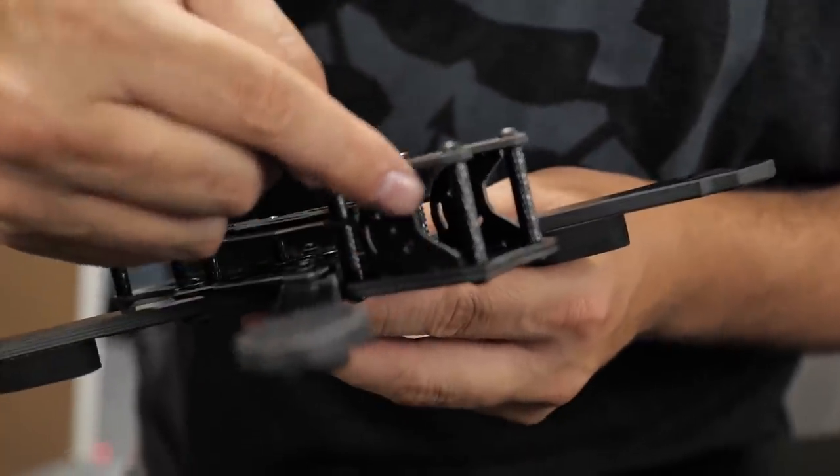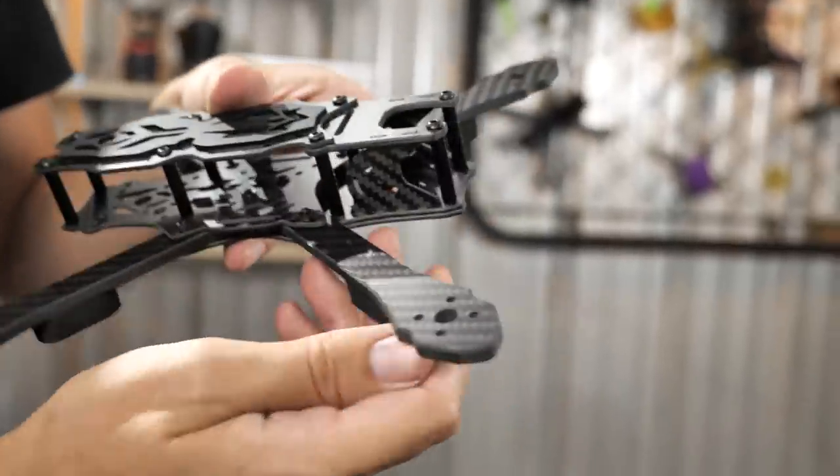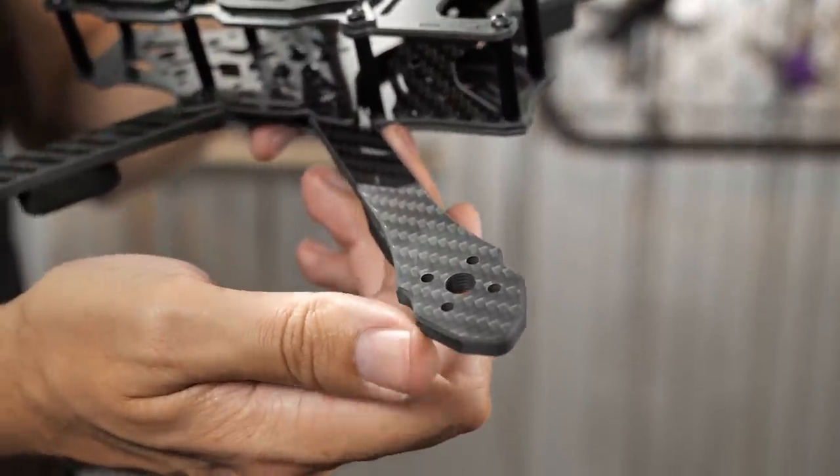This has the holes for the new style of full-size cameras - all straight holes - and it also has the back swoop so if you have an older style camera with that rear cutout you can do that too. I also like that the camera plates have a cutout up front so you can use a 3D printed camera mount that slides over the standoffs. That would be more for a micro camera - you can use a micro camera with a 3D printed mount but still have these plates in place for a little more stiffness and protection. 16x16 motor mounting is becoming more standard.